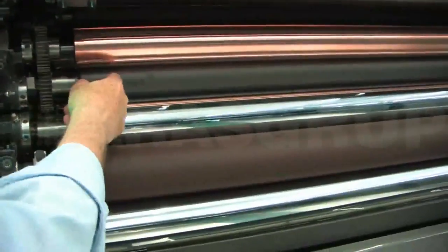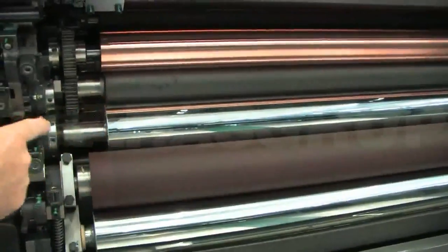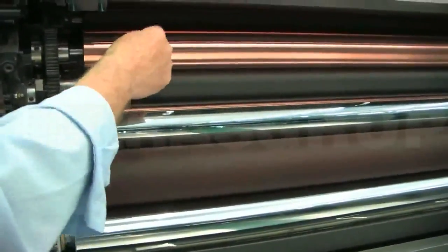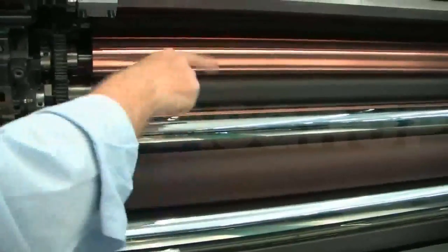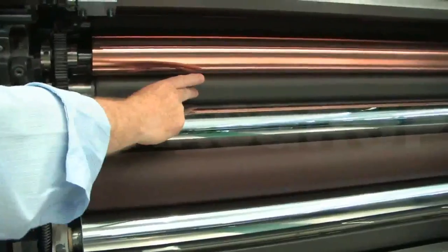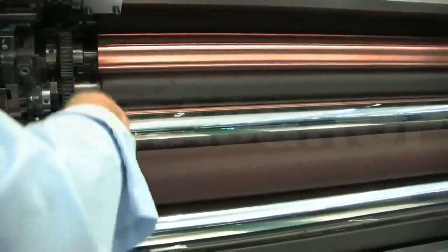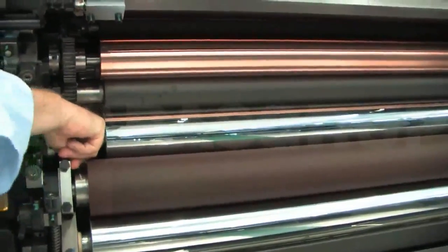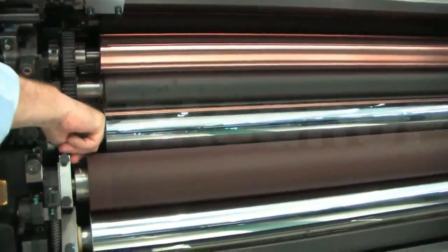On this plate dampener, we have now 2 rider rollers. We have this rider roller on the top, this McKinley roller, which oscillates and turns with. This breaks up the ink film on the roller. And then in here, just below here, is another rider roller. This is a second rider roller.